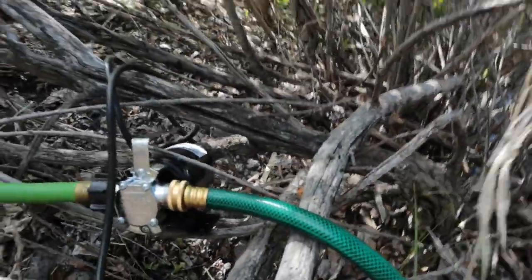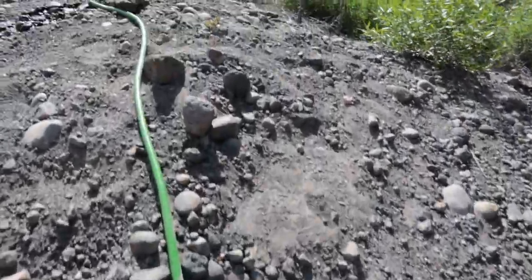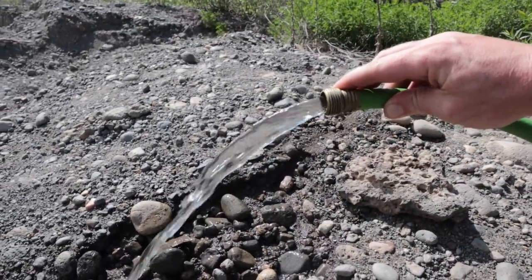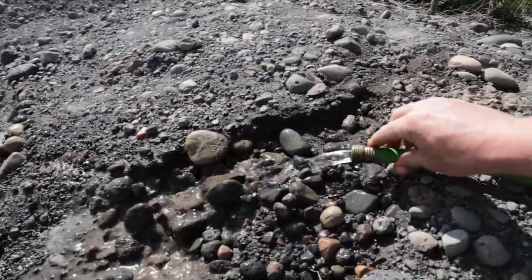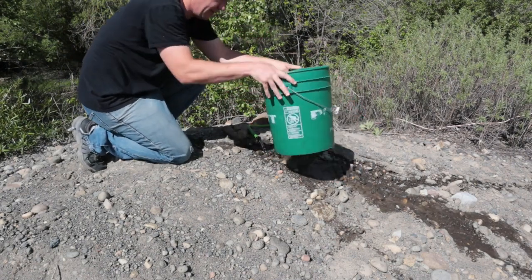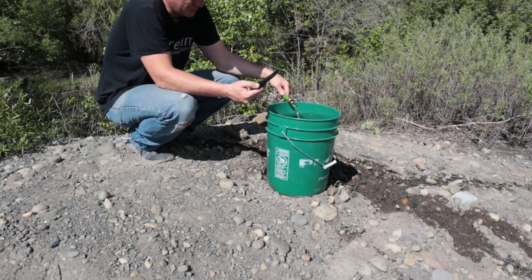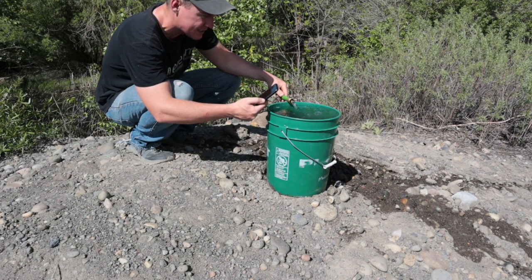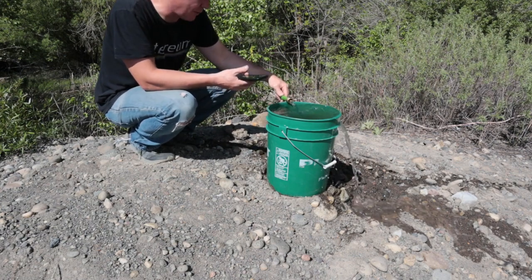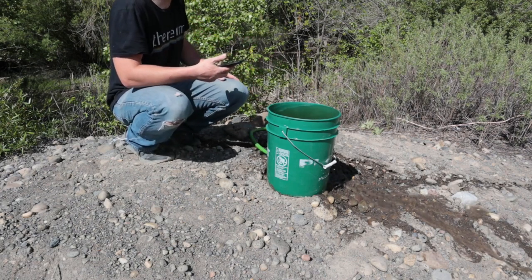So this is pumping up into here — the pump is spinning around and now it's pumping up and out. It's a pretty decent pump. After 15 feet you get about this much pressure. I've got this five-gallon bucket and I'll run a timer to see how long it takes to fill it up. It's just about filled to the top at 1 minute 50 seconds. That's with about 15 feet of lift and about 20 feet of total distance.